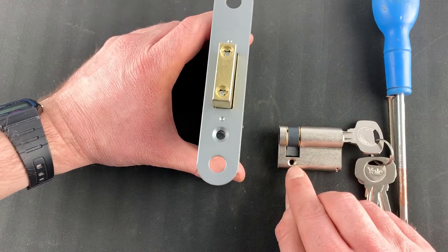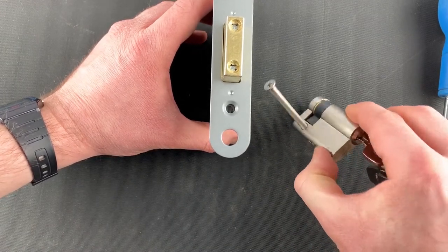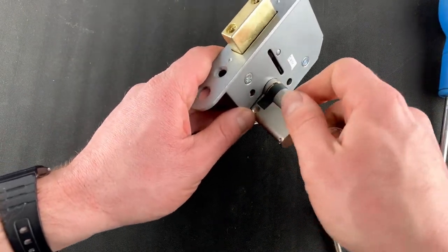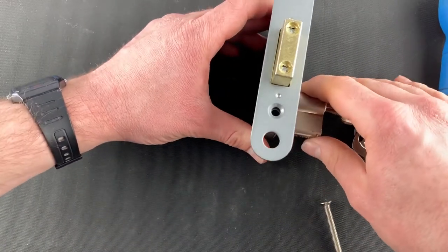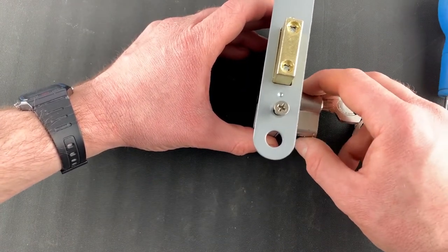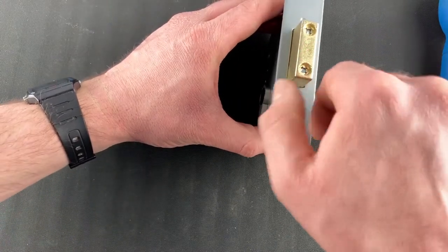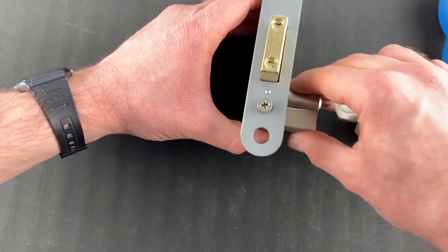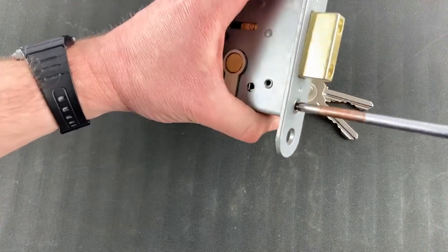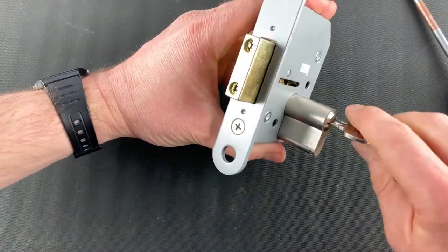Make sure that the hole in the cylinder lines up with the hole in the mortise, because that's where you'll tighten the bolt to hold them together. It's a bit of a blind process, so put the cylinder back in the mortise, pop the bolt in, and tickle it about very slightly — you'll see the bolt start to move when it's roughly lined up. Start tightening the bolt with your fingers, then take your Phillips screwdriver and tighten it up reasonably tight so the cylinder sits nice and tight within the mortise. Then just check it all works.